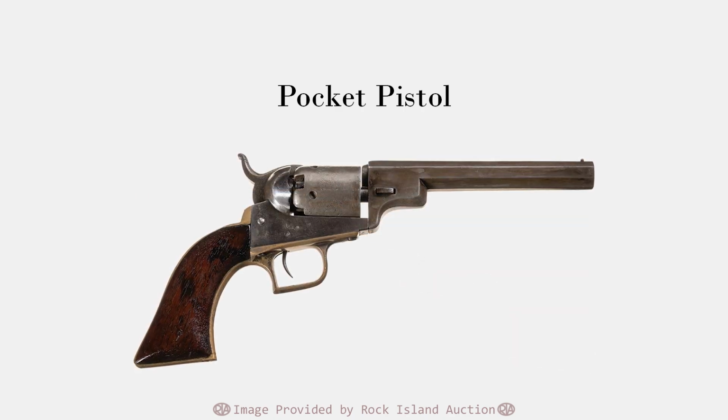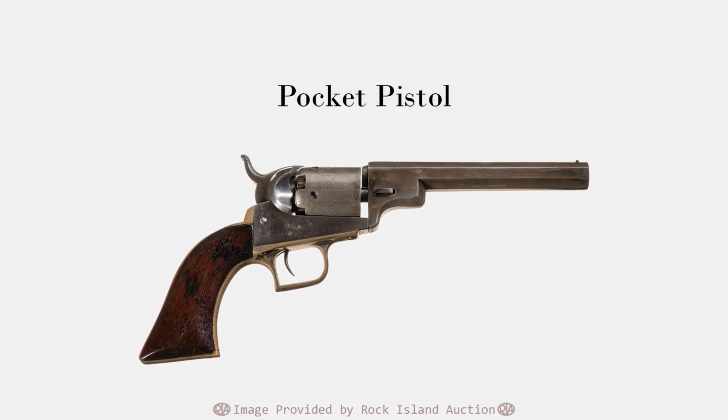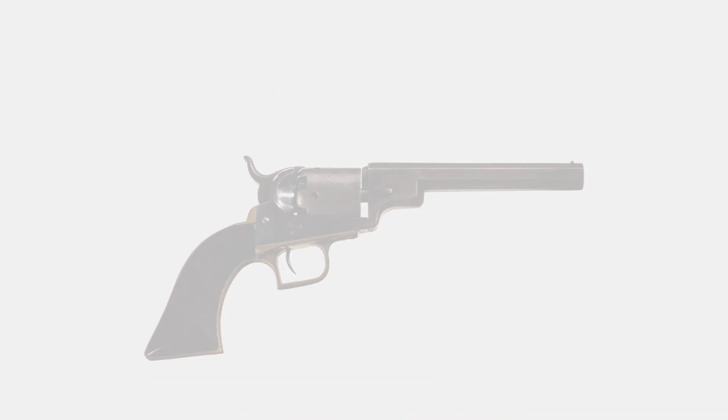There was no cutout in the lower barrel assembly to aid with loading bullets or ball. The cylinders were bored straight, no fancy taper. During the first 100, there wasn't even a cutout in the breech shield for setting percussion caps. The cylinder was only bored with 5 chambers. While there was room for 6, this limit was likely taken to be doubly secure of the thickness of the chamber walls, especially given the previous troubles with the Walker.